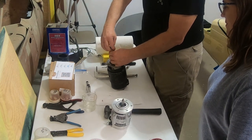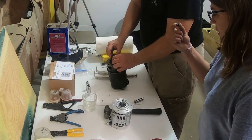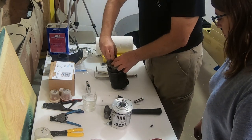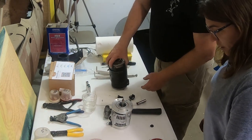Check this out. Oh, that was torqued, right? So it's a good thing we're doing an alternator change out, huh? Shocking. Loose, absolutely loose. Finger tight. That's rubbish. Not 180 inch pounds. Yeah, it says 180 to 220.